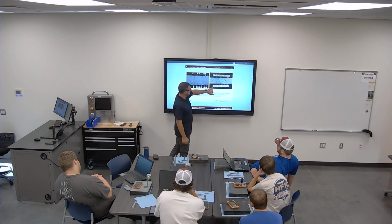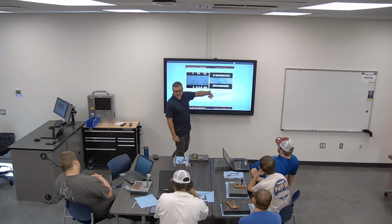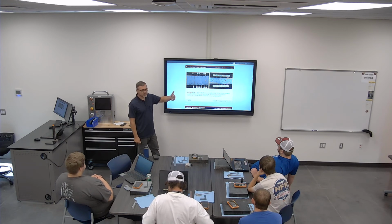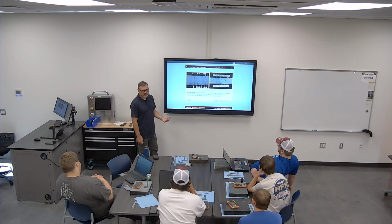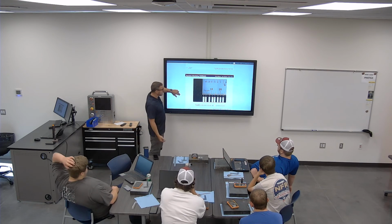Yeah. So anytime you're odd on the top number, it's non-reducible. If it's even on the top number, it's reducible. Typically you're just going to start cutting that thing in half. And when you're talking about fractions, you want to talk about them in their lowest form. So if you come up to me and ask, do you know where some 6/8 stock is? I'm just going to stand there and wait for you to say, what I mean is 3/4 inch stock, because that's what it'd be. Or take it down to decimal for you. Yeah, you can do that too.